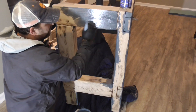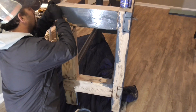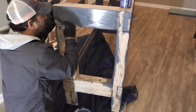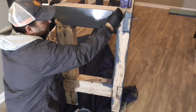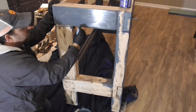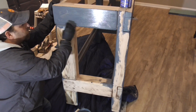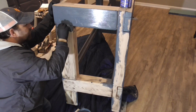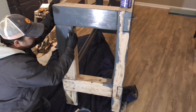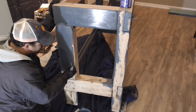I'll show you the whole project — I did the entire bar. This is red oak that I built, and it's actually green timber, meaning it hasn't been kiln dried. These are four-by-sixes and we're looking for a rustic, barn wood kind of look. I don't want to paint it because I want to be able to see the grain through there. I got really good coverage — I wasn't sure if a pint would do the whole thing, and it did. I think thinning it out a little with paint thinner helped it stretch further.